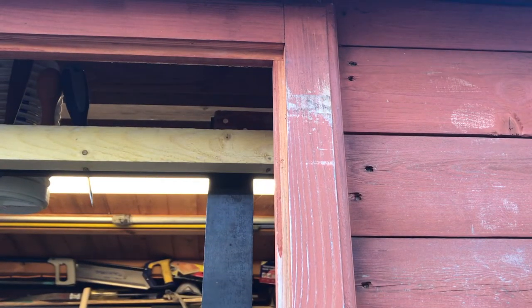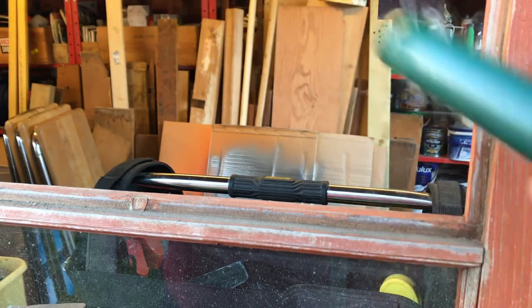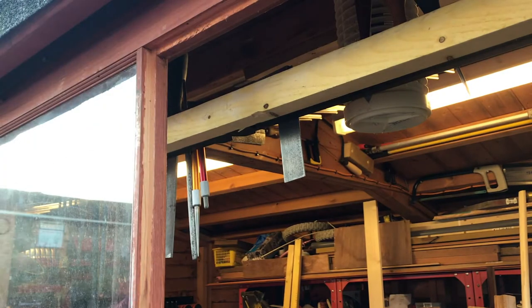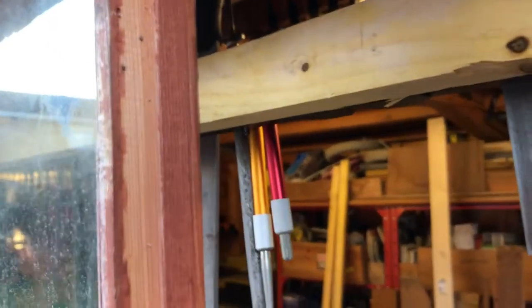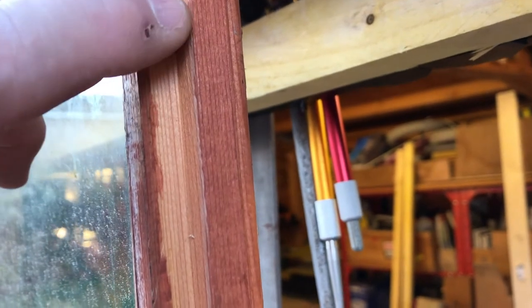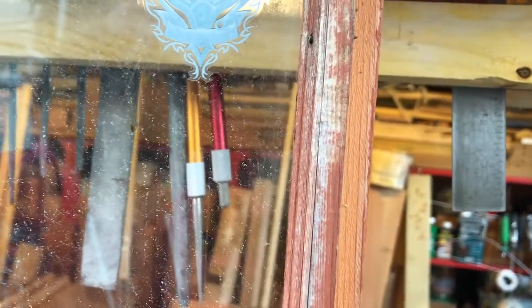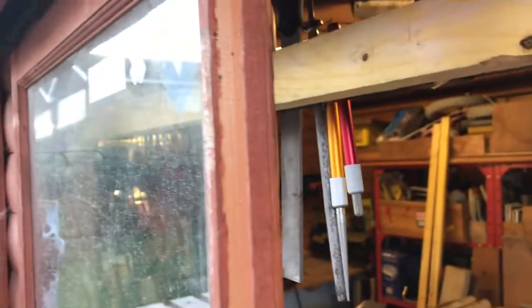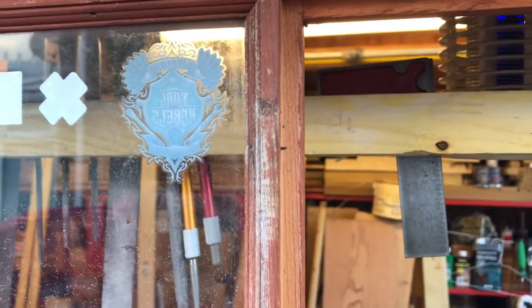Now's the time to go around and have a look at the frame. Use a hack knife, scraper, or similar to tidy up the frame — make sure there are no sharp bits or nail stubs sticking out, as those will ruin your day. Clean up your frames and use a dust brush to get the dirt and junk out. Always run your fingers down the frame. There's a nail poking through from the other glazing bar that I haven't driven in yet — I'm going to drive that in now before offering the glass.